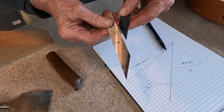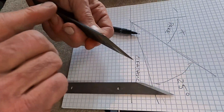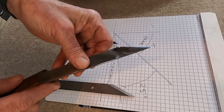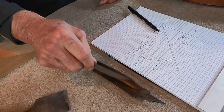This will sweep and scoop through the material, and it's easy to steer and easy to control. So I suggest that if you have a violin maker's knife, you try to shape these edges in this nice way so that you can get more control. It's also useful to make the edge very slightly rounded so that there's a little bit of a curve in this direction — not critical, but it seems to make it more useful. And finally, it's nice to have a handle.